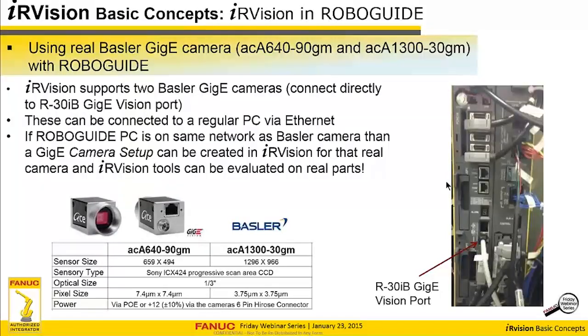We have a question: 'I am using a GigE camera using the Basler Pylon IP configurator and RoboGuide sees the device but not getting video feed.' I've seen that too. One thing I would try — if I'm on the building network, sometimes it works, sometimes it doesn't. With the Pylon, I'd try setting it to DHCP — usually that works for me. Set the camera to DHCP and if your computer is on the building network, it'll see it. If you want, send me an email or give me a call and I can help you further.